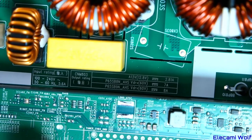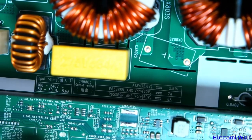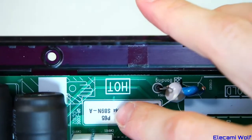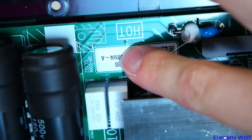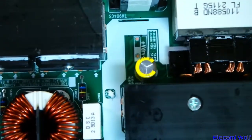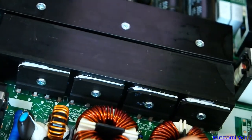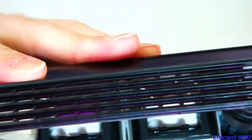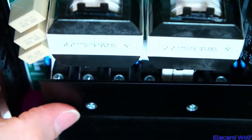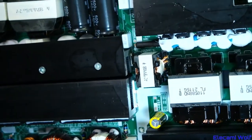There's a sticker — this is the 9N version, the most grunty one. There's a test point here showing 50.4 volts, though it started out rated at 60. Wow, look at that — there are four bridge rectifiers in a row, all joined in parallel, and a whole bunch of devices on those heatsinks. We're going to have to get this out for a proper investigation. Presumably this is all an active front end — maybe a two-phase active boost converter into these caps.